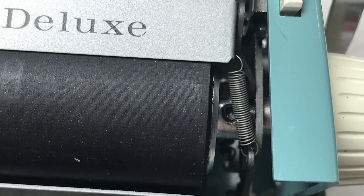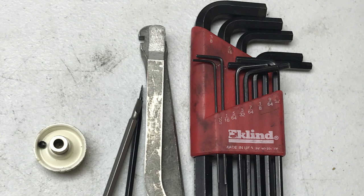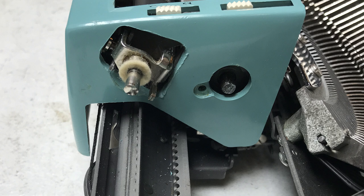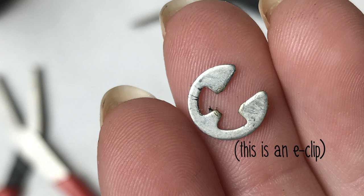These more modern typewriters aren't designed like 1950s machines. The platen is held by hex screws — new to me — which you use an allen wrench on. It took several tries to figure out since the caps had no visible screws. Once you remove the hex screws, you pull off the platen knobs, take out the platen, and find two hidden screws underneath holding the top plastic piece. I also struggled getting an arm off because I didn't know it had an e-clip. Learn what e-clips are — they're very helpful.